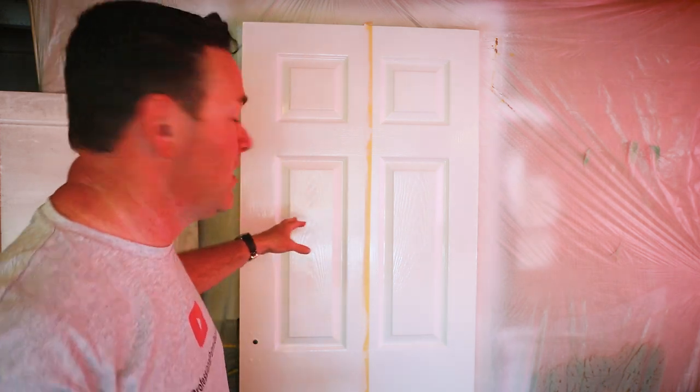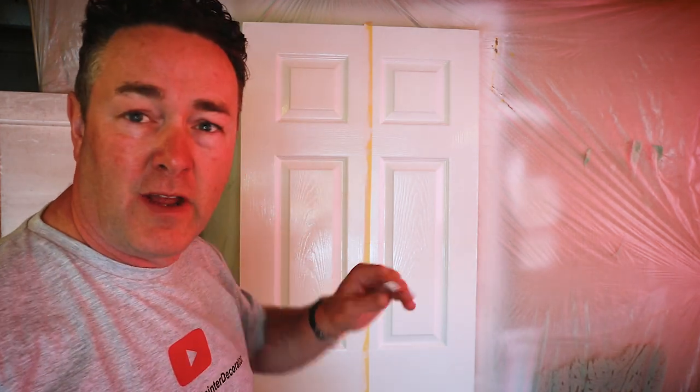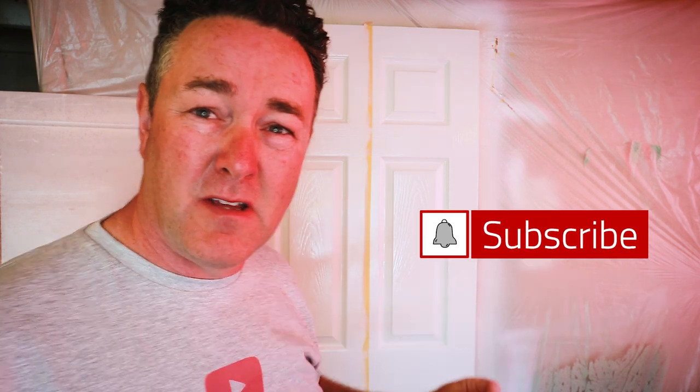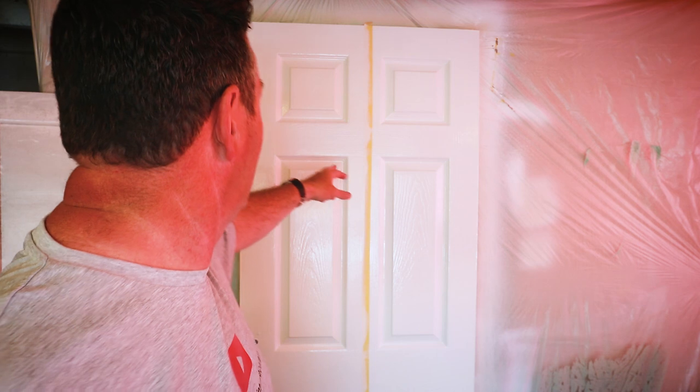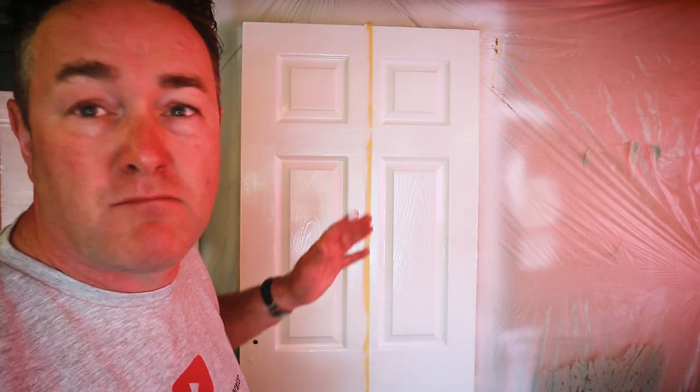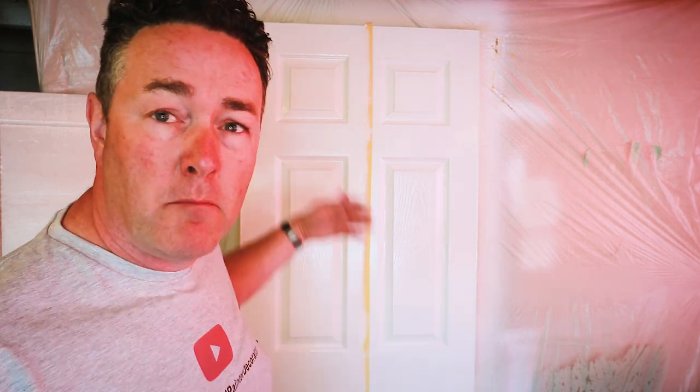You can see that's laying off lovely. If you're an old-school painter and decorator who goes on about brush marks in water-based paints, once you start getting to this top end, better quality water-based paint, you don't see brush marks. It's an urban myth. We've got sun shining outside which makes a change from being in the UK, and that has laid off lovely. Just got a little bit of a run there, but nothing untoward. Didn't dry off on me too quick, and the application is superb - can't fault that. You did see where there was a little bit of marker pen - I had spread that over some blockade. I'm hoping that will cover because the blockade is only a barrier to stop anything coming through, so more coats of paint over that should be fine.